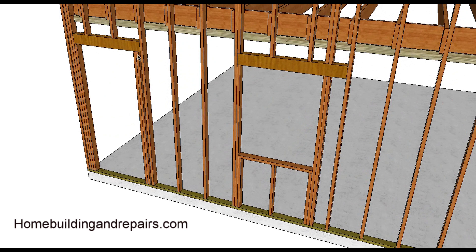A lot of times you're going to have a header go past on this type of framing. If you are remodeling something, this is probably going to be the way to do it — have the headers go in between the existing wall framing studs. Of course, you would need to cut the tops or bottoms to make the headers fit in there.